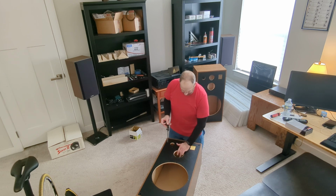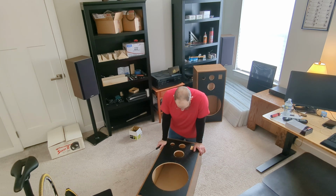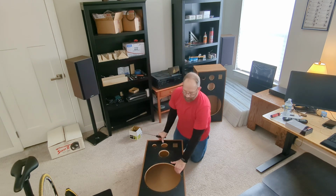So basically, something you may have learned in shop class, if you took shop class like I did, is if you want to notch something, best way to do it is by cutting straight lines through it. You want to go as deep as the notch is, and then just start breaking out those little teeth. So it's going to wind up looking like a comb.